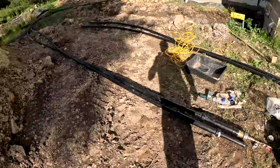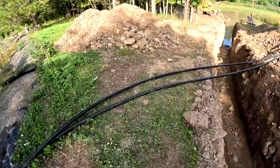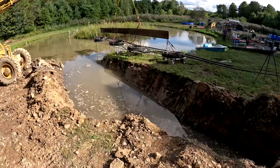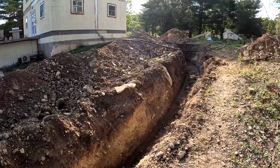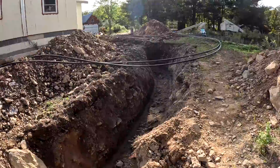So it's looking good. I knew that though. It's not very likely that we'd have a leak, but it's good to test it. Eric was also saying that he has an additive that you can put in here if you have a leak that's up to an 1/8 inch hole, and it'll plug it up. So if anything ever springs a leak in the future, you just add that chemical to it and it'll patch up the hole. And he said he's used it before on other people's work and it worked. He's never had anything that he had to use it on for himself, but he's had to go on other jobs where other people did the work and then it leaked, and he went in afterwards and fixed the leak with that chemical. So it's good to know that you have that for a backup. I wouldn't want it running through the system unless it had to though.